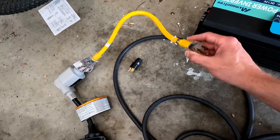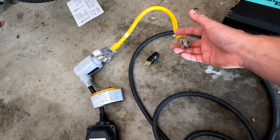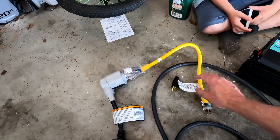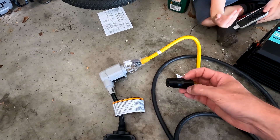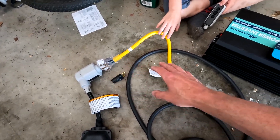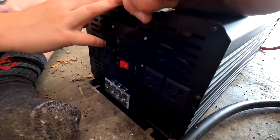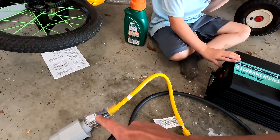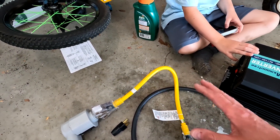Next I have just a little two-foot long extension cord. You want to make sure and have a heavy-duty extension cord — this is a 12/3 so it has 12-gauge wire inside. I chose to get one that has three prongs on it for the fact that I'm going to need to be able to plug in my neutral ground bonding plug into it. Do not just go out and get an ordinary extension cord that's 16-gauge wire because it will get hot.